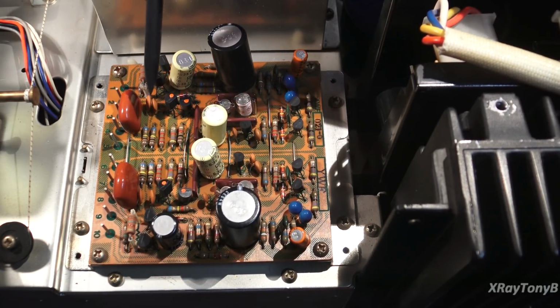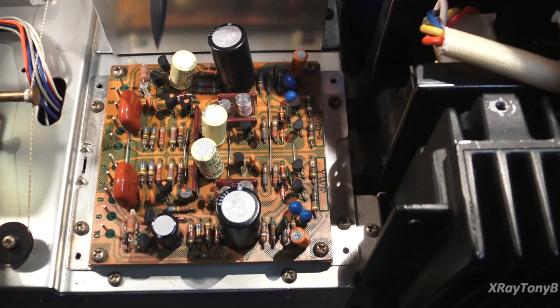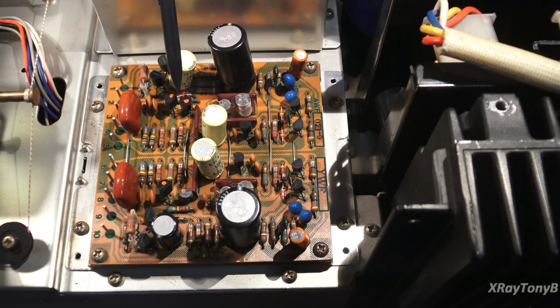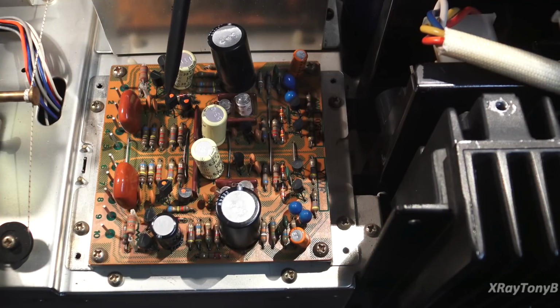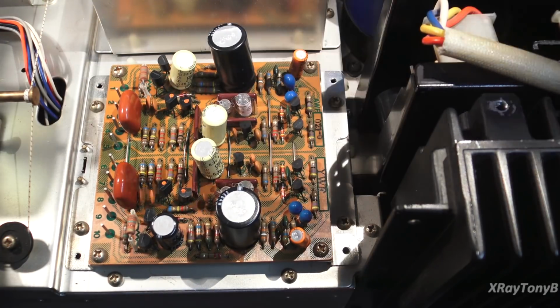In that way, rather than going through the tedious task of trying to match your transistors when they built these, if you picked 2 of them with the same color dots, you knew they were in the same range and they were pretty close matches. So it's kind of a production way of matching transistors ahead of time. That's at least what I've always been taught. So anytime you see these with these dots and you need to replace one, you have to remember that you need to replace them as a pair and they need to be matched. That's pretty much what that means.